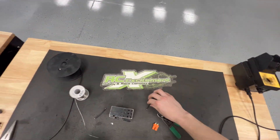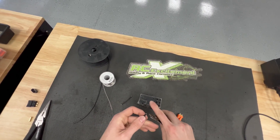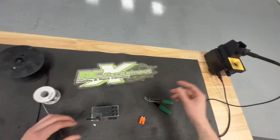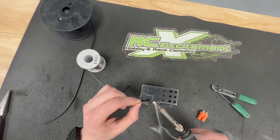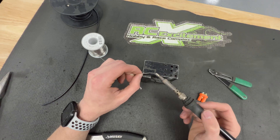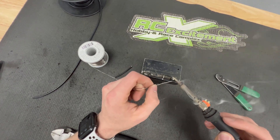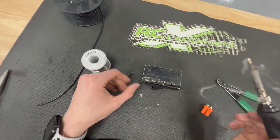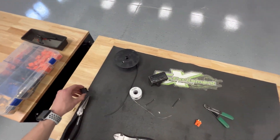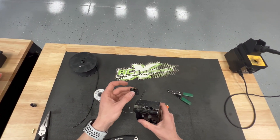From here I'm going to repeat that step one more time just so we can get two wires — both black, but just for demonstration purposes. This is TQ-13 gauge; I use this in race vehicles. TQ is a nice thin wire on 13, very flexible and very easy for soldering. So once again, start from the back, feed it into the front. We're going to get everything tinned first so it's kind of like an assembly line. I have my Traxxas connector here — it's one of the Traxxas 4S connectors so we can fit any type of battery in any 8S or 6S vehicle.